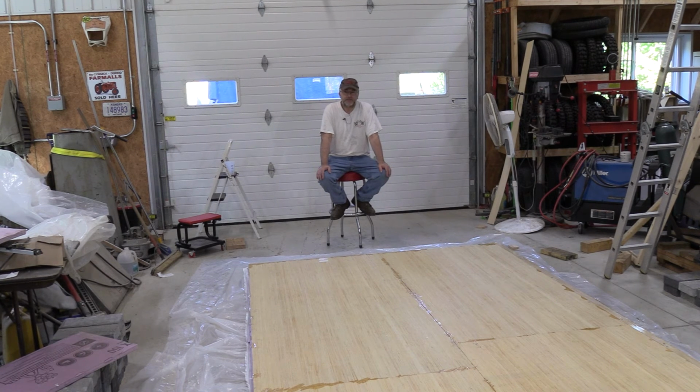So I don't think I'm going to film much of what I'm doing today. Today is mostly a repeat of yesterday. This is the interior face. Since most of it is not exposed to any weather, I'm only doing 4-ounce fiberglass cloth, where I did 10-ounce on the other side. The exception is the lower 12 inches or so, which extends below the floor. That's the part I'm most concerned about, getting rock chips and things like that. So I'm going to do the 4-ounce everywhere, and then an extra layer of 10-ounce just on that lower edge.